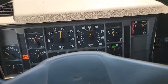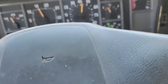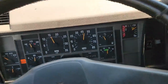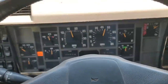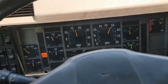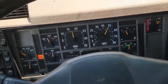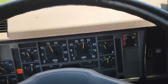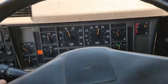Just taking her down the road to make sure she does everything she's supposed to do. Since we've done a little bit of work to her, we want to make sure all the gauges are where they need to be and it runs and drives like it should. The engine warning light is on. I checked the code for Justin — it's a high pressure oil code and he thinks it might just be an IPR, so he doesn't want me to do anything with that. He's going to look into it — maybe a high pressure oil pump, could be an O-ring on an injector, could be the IPR. It runs, drives, steers, and brakes like it should.